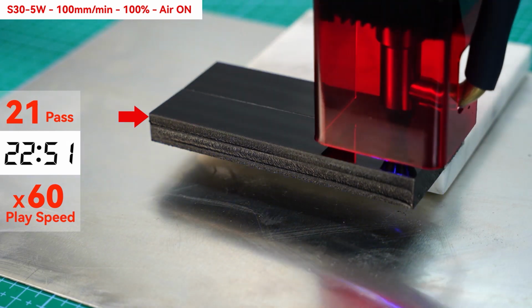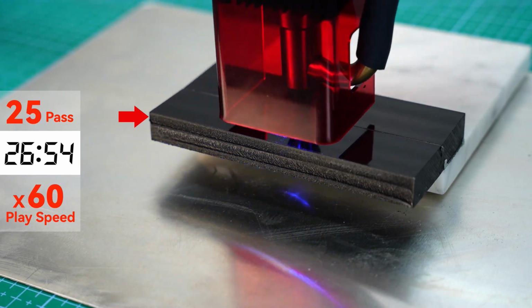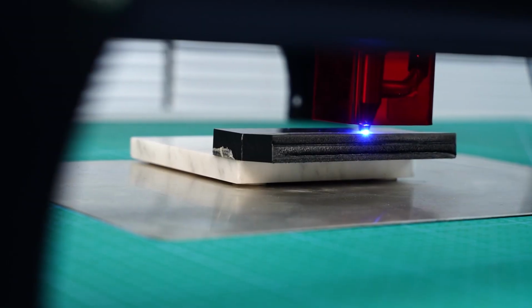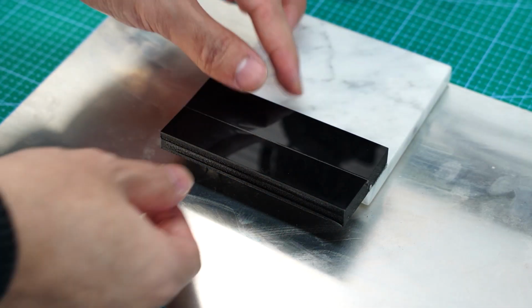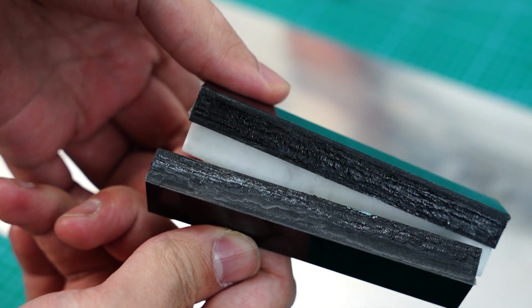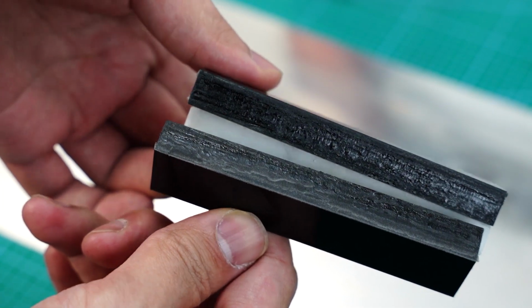This test is completely failed, probably because the bottom was adhesive and expanded by heat, resulting in the upper half of the gap to close again. It's easy to break. In fact, it has been cut through for a long time, but part of the plastic is not completely cooled after heating, and then glued together again.